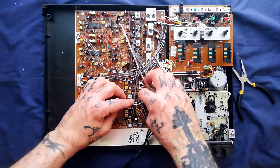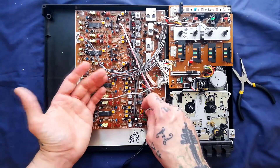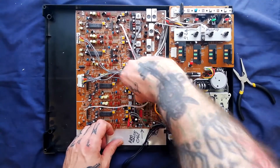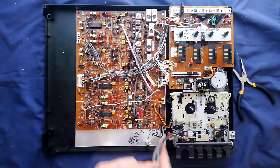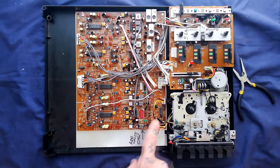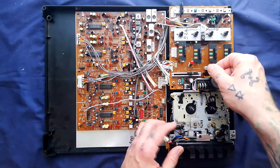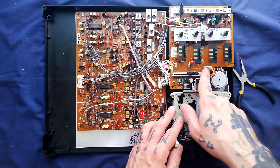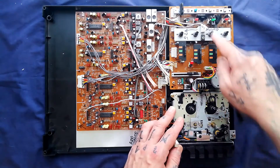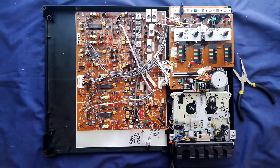Once loosened, I can pull that out with my fingers. The record/playback head — the rightmost of those two — splits into two connectors, color-coded to match their headers. The connector is like the plug; the header is like the socket on the board. Again, I'm pulling from the plastic so I don't put any strain on the wires. All three of those cables are tidied with a cable tidy in the bottom right of the record/playback board. Some control signals reach the record/playback board via a header at the bottom right, and then there's another connector for probably the motor power. The counter connects here but joins the EQ board up top, so pulling that out completes all the electrical connections.